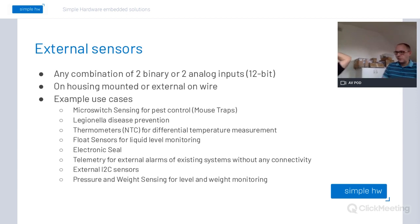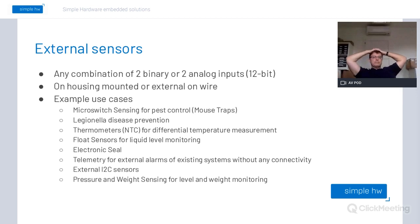I think there are basically two standards that are the most common for external sensors, SPI and I2C. And basically, you can get any external sensor you can imagine with I2C, correct, David? Yes, there are more industrial standards like RS-485, and I think we can add such functionality as well. But it depends on the use case. It's just software logic that can be embedded into the firmware. If you need another protocol, for example, Modbus or something, it can be done on the wires.